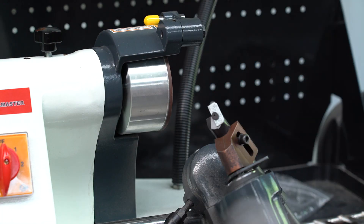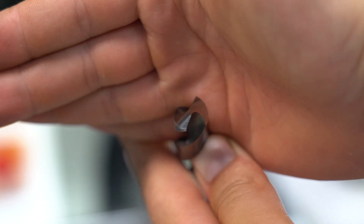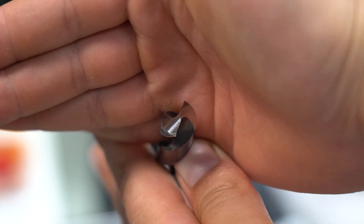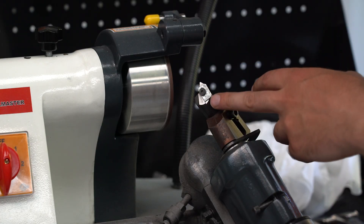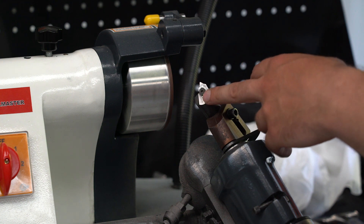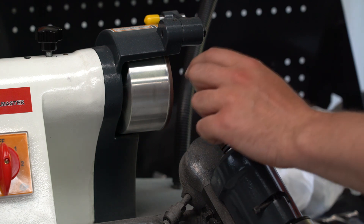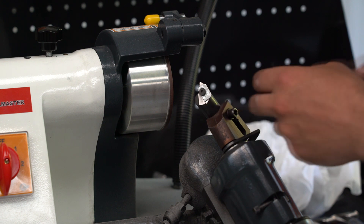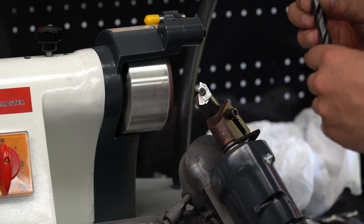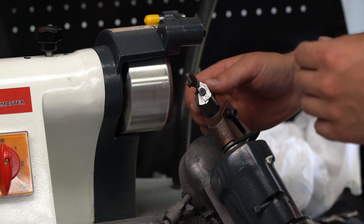We'll just remove the first millimeter. As you remove more metal you should get closer and closer to something that resembles a drill bit. Since we started grinding I removed about 4 to 5mm and then readjusted the distance to 3 times the diameter of the drill bit, did a few more passes, took about another half a millimeter, and we're finished.